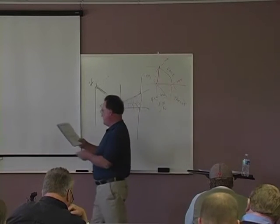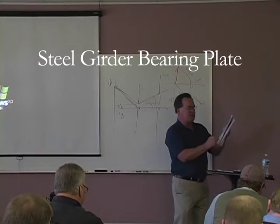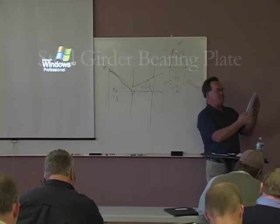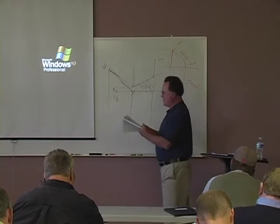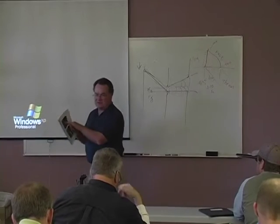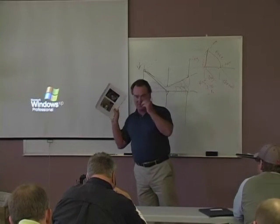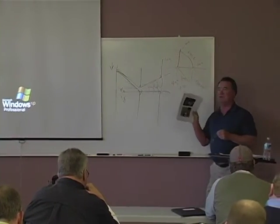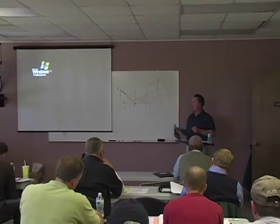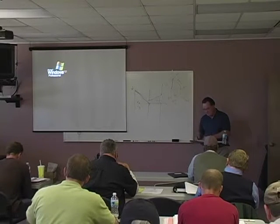The next welding procedure is for the steel girder bearing plate. Notice that I've included a note about 250 degrees in the proximity of the elastomeric bearing. The biggest problem you're going to run into — Jeremy Guy took this photograph — is the best illustration of overlap I think I've ever seen. That's the biggest problem: it's a 5/16ths weld and he's going to come out with an eighth-inch welding rod wanting to produce that 5/16ths weld in one pass. What happens? It gets fat, it starts lapping over, and you get that overlap condition.